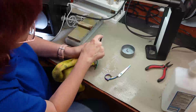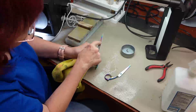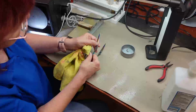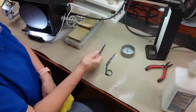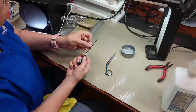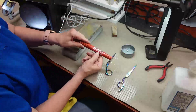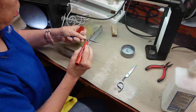Can you see that, Josh? See the silver going up the back. They probably put their pressure in the center because I'm seeing it up the back there — see a little bit here — so they may not be putting pressure in the right place. And I didn't check these to see how they cut, but I'm sure they didn't cut well because there are huge nicks and all kinds of angles on them.